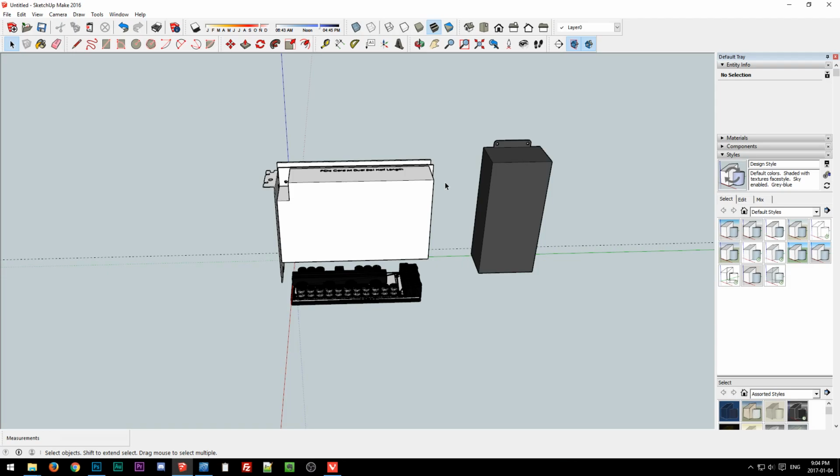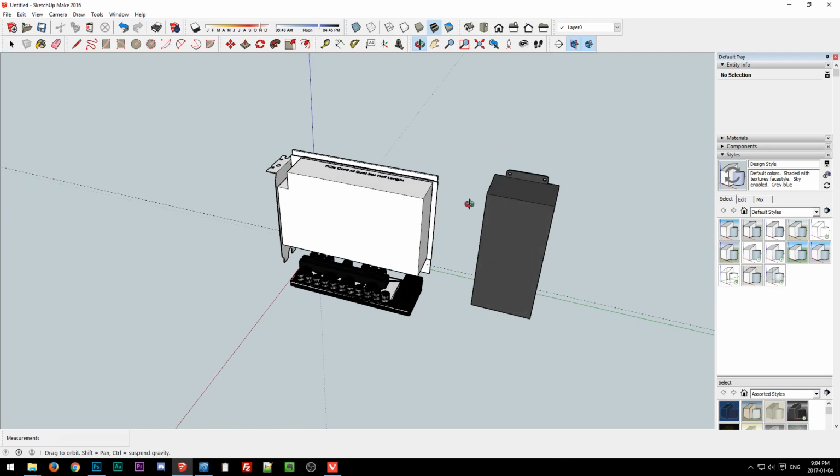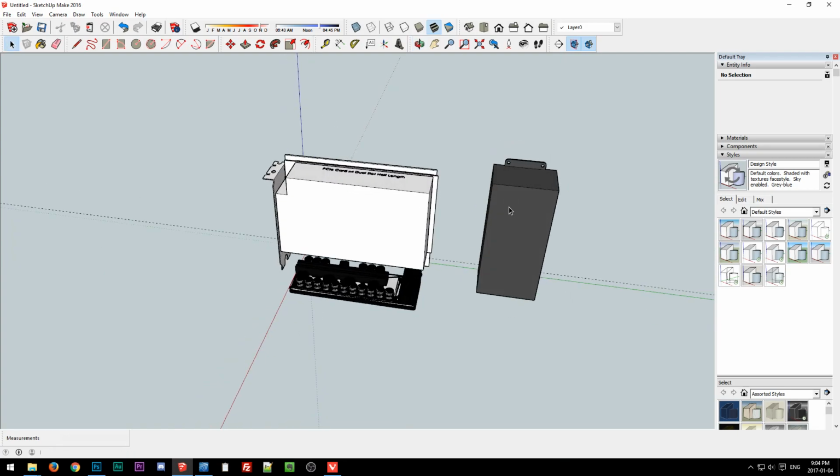So we'll assume most people would want something in the 190 to 220 range. If we do that, and I think that's what I have modeled here right now, yeah, 220, then that would cover most of your mid-range, maybe high-end SFF type of cards. And if you do want a reference NVIDIA card or a non-SFF card, up to 285. That would cover basically all your 10.5-inch class video cards. So that would be your reference 980 or 1080, reference Titan, or well, all the Titans are references, but yeah.